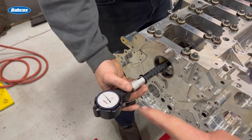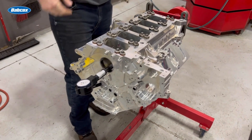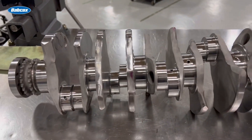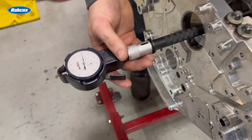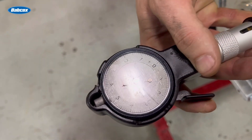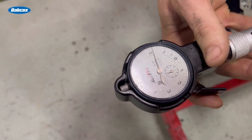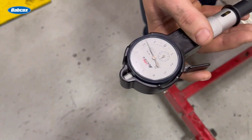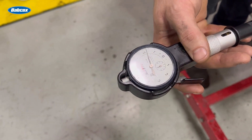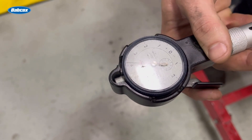What we're going to show you is how much the block grows and increases bearing clearance. The gauge is currently set up at crankshaft size. So what you're reading here is clearance. That is one and eight tenths — going down checking each bearing — one and eight tenths, one and eight tenths, maybe seven tenths, one and seven tenths, six... that's seven tenths.